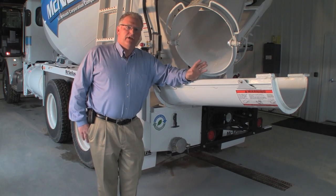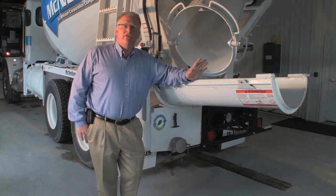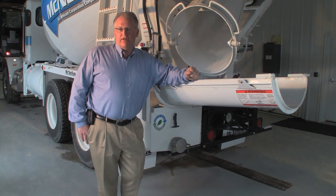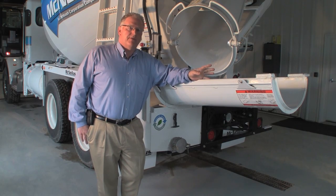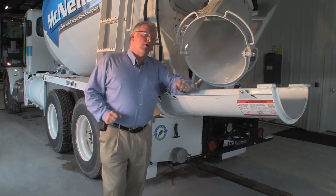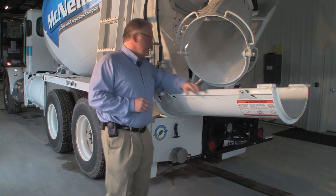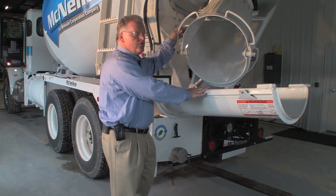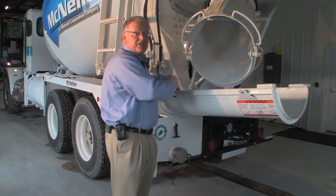In addition to capturing cost savings on your truck turn, there is also the opportunity to increase your revenue by capturing environmental fees. Based on a $10 a load environmental fee, you can get over a 500% return on your investment on purchasing a Chute Wash Recovery System. Once you're in an appropriate place to start your washdown procedure, the first thing you're going to do is lift the lid on the box and hang a chute on the uprights, then move the main chute and flop it down into the washdown position as you see here.